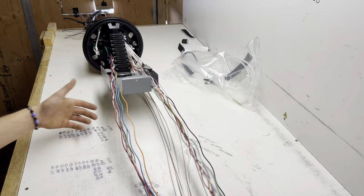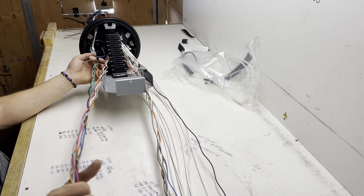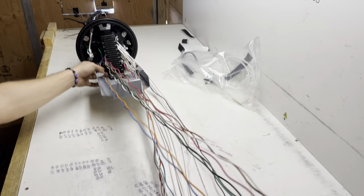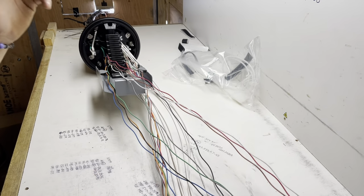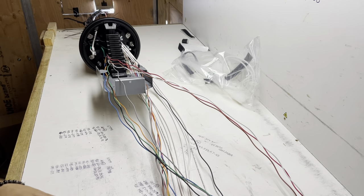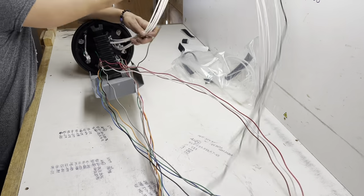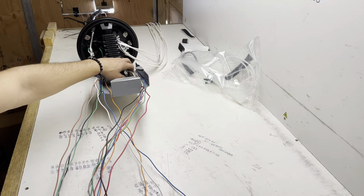Customer spec, anytime there's a feed cable, doesn't matter how many are live, there's only two coming in live here, the rest are all dead. You still want them all in tray just in case in the future when they send new light this way and have to expand farther down the road, the tech doesn't have to mess with the feed cable. It just comes in, it's already in tray, and you can just pick what it needs and get to it. But on the distribution side of things, we don't need to do anything like that. That can all go to basket.